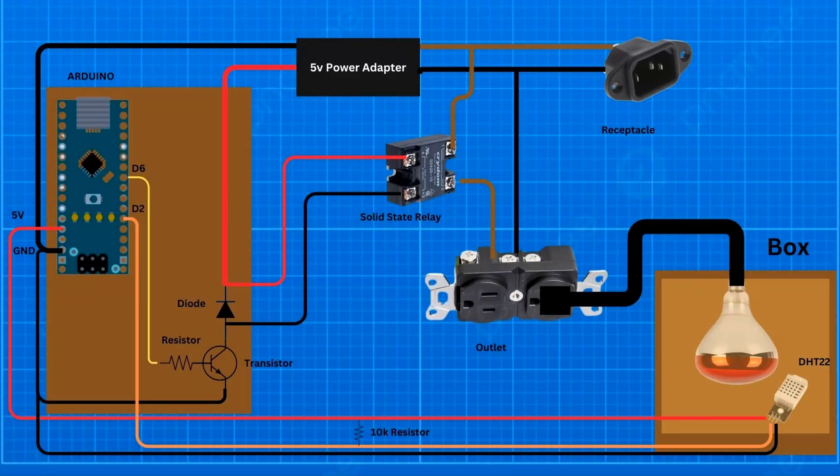In this case, it's a heat lamp. To give you a clear picture, this is an illustration of the circuit. At the heart of it is an Arduino microcontroller, which monitors the temperature inside the chamber through a temperature sensor. It will then switch on and off a relay, which will supply power on and off to the receptacle, which will in turn switch the lamp on and off to maintain the set temperature.